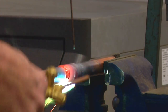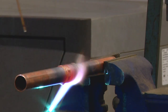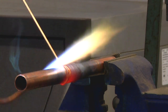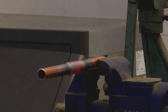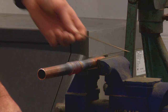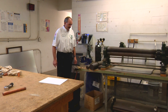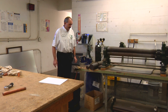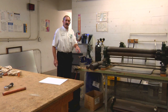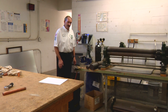That would be basically the extent of the size you would need to do for a joint of that size. As it cools, you can see that the copper on the outside — the fittings — start to turn dark. We'll let it air cool for a little bit and then we'll wipe it down with a wet rag, and you'll see some of that oxidation on the outside come off. But what you see on the outside of that pipe is also on the inside of that pipe, and we'll show you that in just a little bit.